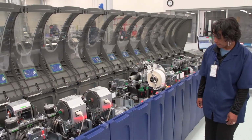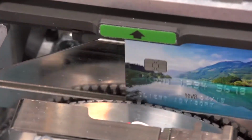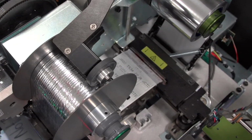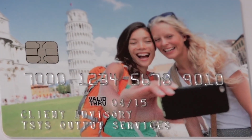Now the card is ready for your customer's data. Each is embossed with the specified name and card number, with an additional tipping process to add color to the raised letters and numbers. Then the magnetic stripe and chip are encoded, and the card is spot tested for an additional and final time before the process is completed.